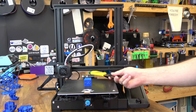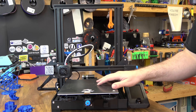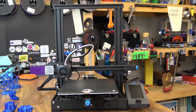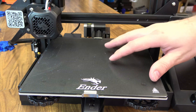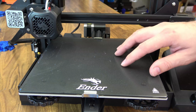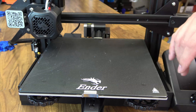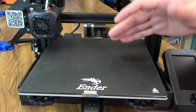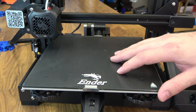Now on to the V2. They've changed up quite a bit, but let's start with the bed and work our way around. You don't lose any build volume on the V2 — it is still 220x220x250mm. On the bed, you now get a glass sheet with a textured coating that Creality says they've developed, though it does resemble Ultra Base from Anycubic and works kind of the same way. It grips pretty well, leaves an interesting texture on parts, and as it cools off the parts come off pretty easily. It isn't my favorite build surface — I prefer something like PEI — but it is a glass sheet so it's going to be just a little bit flatter, though it does add a lot of mass to the Y carriage.